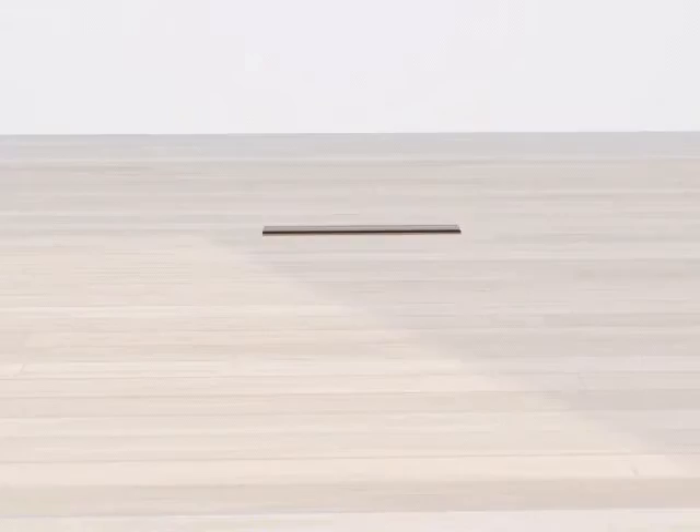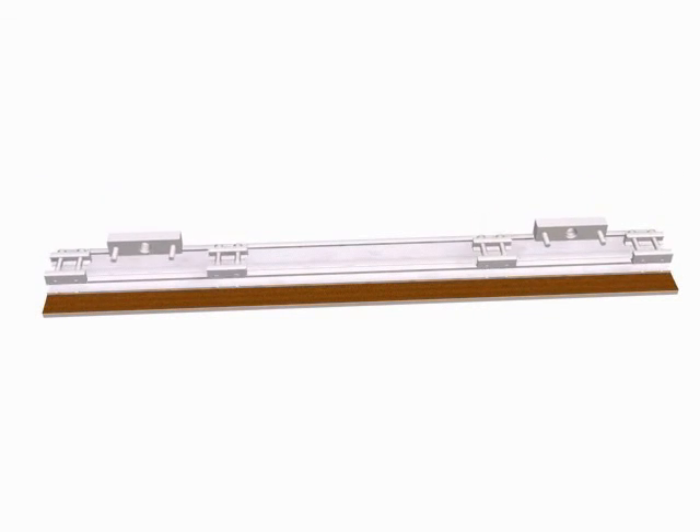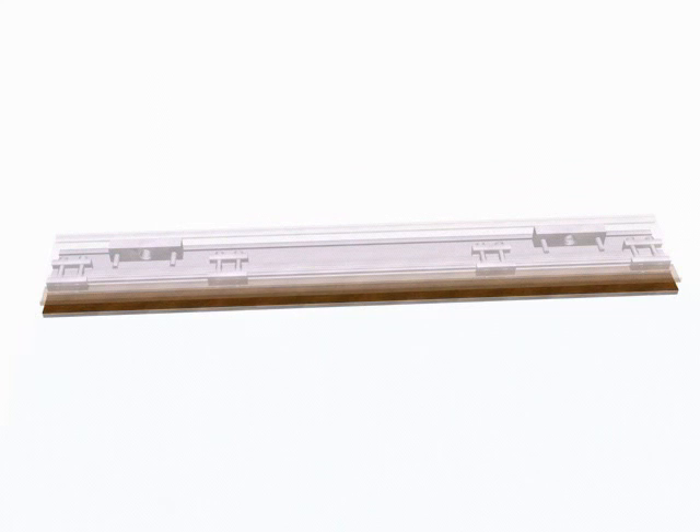In the case of the central pane, begin by fitting the top clamp. Take one side of the clamp and fit its tightening screws. Next, fit the opposite half of the securing clamp, insert the pane into the clamp, and secure the glass using the tightening screws.